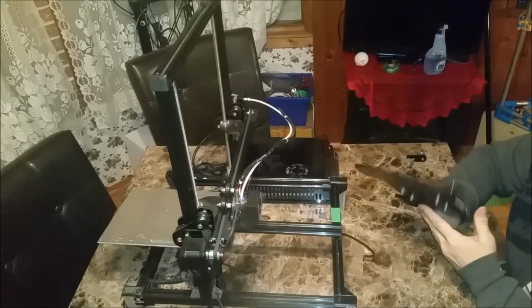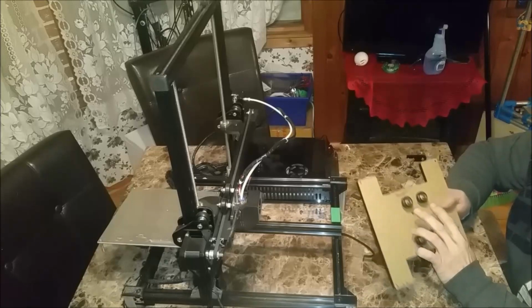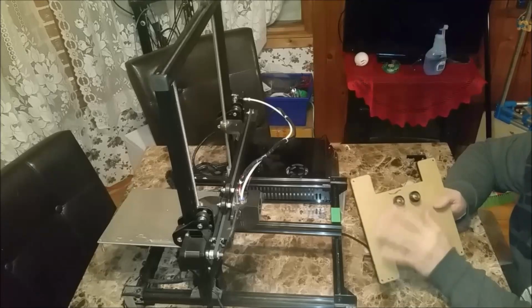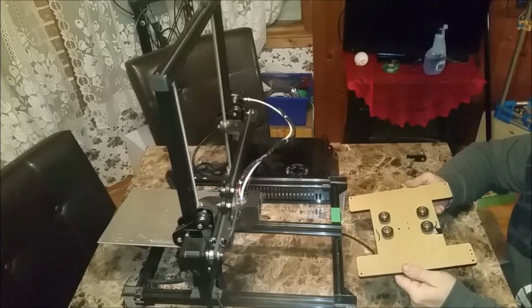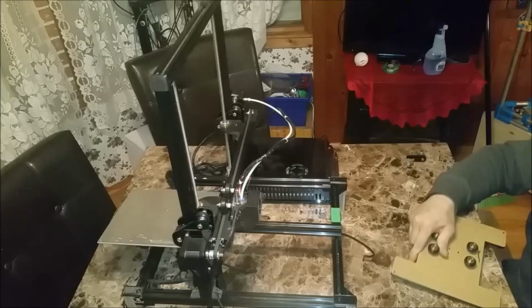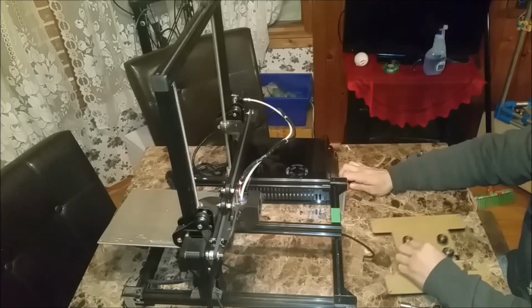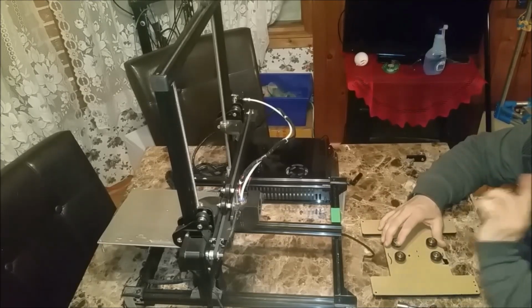Second thing I'm going to have to do to get that other 30 is I'm going to do a second set of holes for these wheels. I'm going to go in about 15 mil on either side. I'll test it out for stability to make sure it works. But I can't see why it wouldn't. They'll only bring them in this far, so we'll see how that works. So the two key things I'm going to do are, firstly, I'm going to move these wheels in about 10 or 15 mil, and that should give me pretty much 300 mil on the Y-axis.